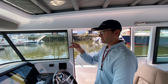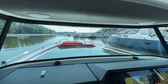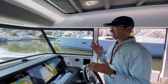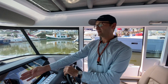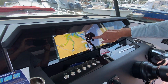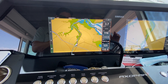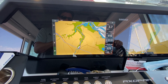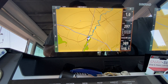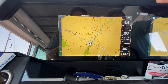As you can see, it is flat calm here on the Royal River. There is some current, but we're going either directly with or directly against it, so it won't offset our course over ground. You can see on screen we've got about 118 course over ground and about 126 heading, so our heading is a little off. We're going to show you how to fix that, starting with determining where the heading information is coming from.